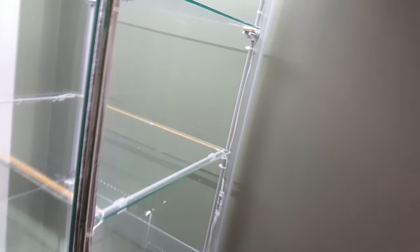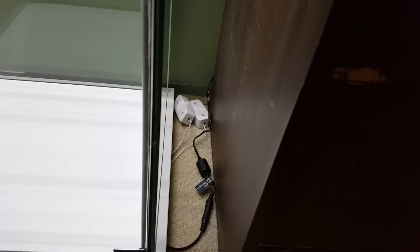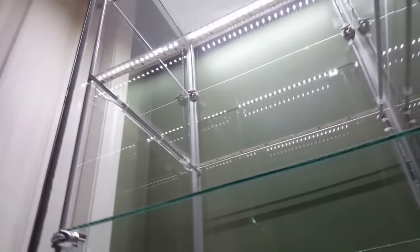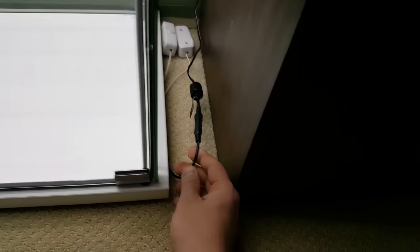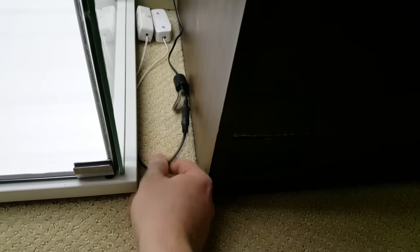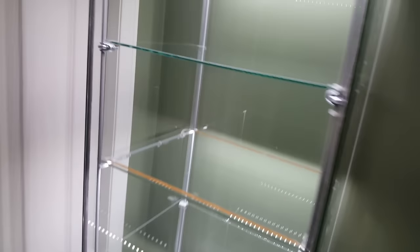Once you have it wired up, I bought these little rocker switches from Home Depot — about seven dollars each, a bit expensive, but I went with two so I can control the lights better. Right now we have the top on, and flipping this switch makes that light come on to brighten it up. I used a 2.67 amp power supply that plugs into the adapter that came with the LED strip light kit, and I soldered those together.